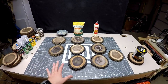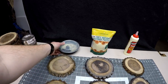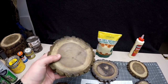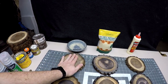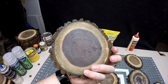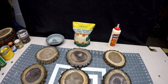Here they are — all from one log, oak again, one month old. I went back and tried the mineral oil and beeswax mix, which becomes an almost chapstick-like consistency, and wiped it on. Again, it looks really good — no cracks or checks, and wipes on really easily. I also heated the wood up in the microwave oven first, then wiped it on, and it did a really good job as well — no cracks or checks. That confirmed it wasn't just a fluke.